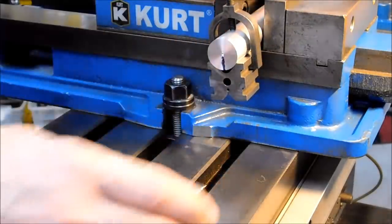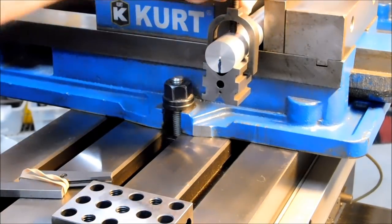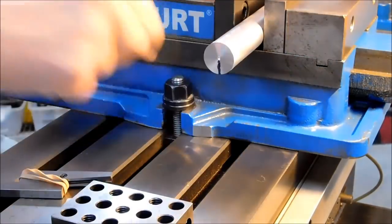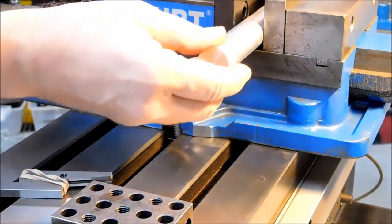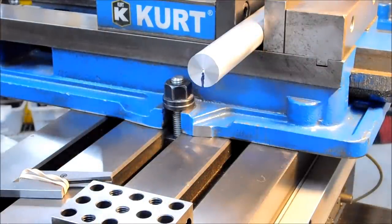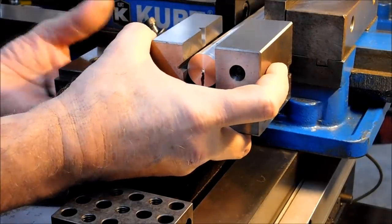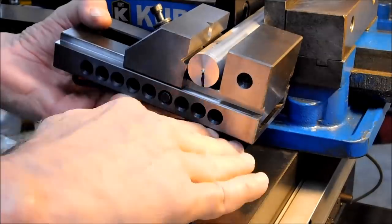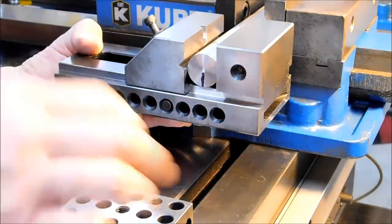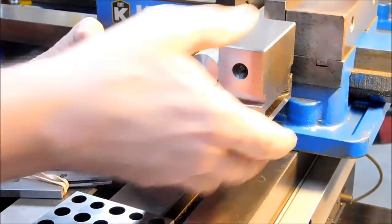Another trick: you can put this end in a V-block so that you have your 45-degree reference. And this one you're going to laugh at, but believe it or not I've seen it done many, many times — I've actually seen guys hang complete vises on the end of their part, and that way they have a tremendous reference surface to work from so that they can use a protractor, a sine bar, a sine plate, angle gauges, whatever. Don't be afraid to do that. It's not unorthodox, and if it gets the job done, have at it.